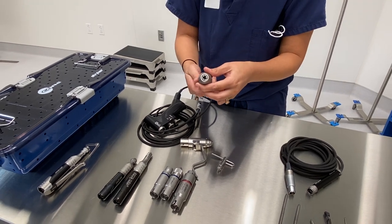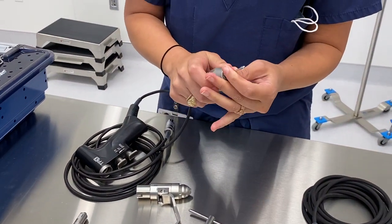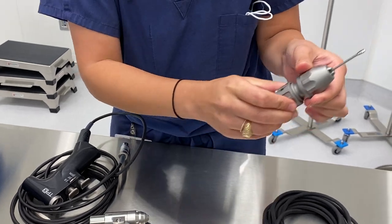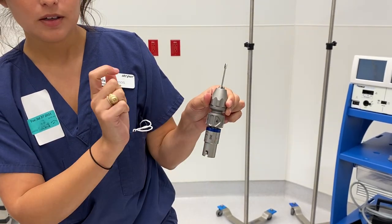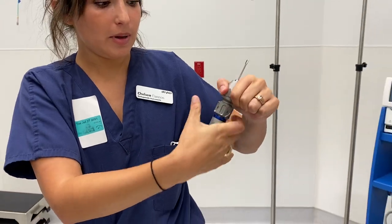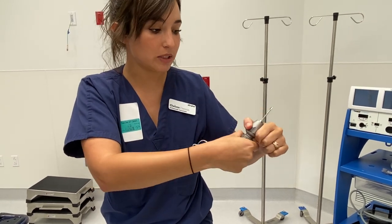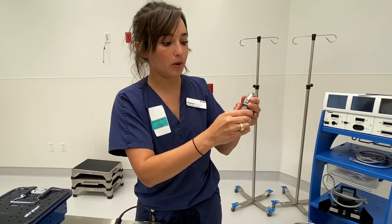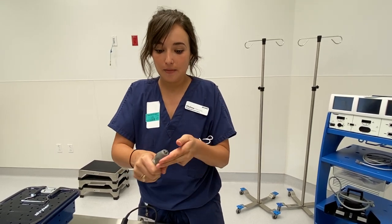To tighten the keyless chuck, kind of put the drill bit in the middle, twist to tighten it up. You'll see these arrows — go towards that arrow. It looks like it twists and you might think it's tight after it goes over once, but you're not fully tight at that point. You want to hold it and give it those extra three little clicks — hear those clicks? Now you're fully ready to go. If it's slipping at all, give it those extra clicks to make sure. To release, just go the opposite direction and it comes straight out. Tighten all the way, wait for those little clicks after, and you're good to go.